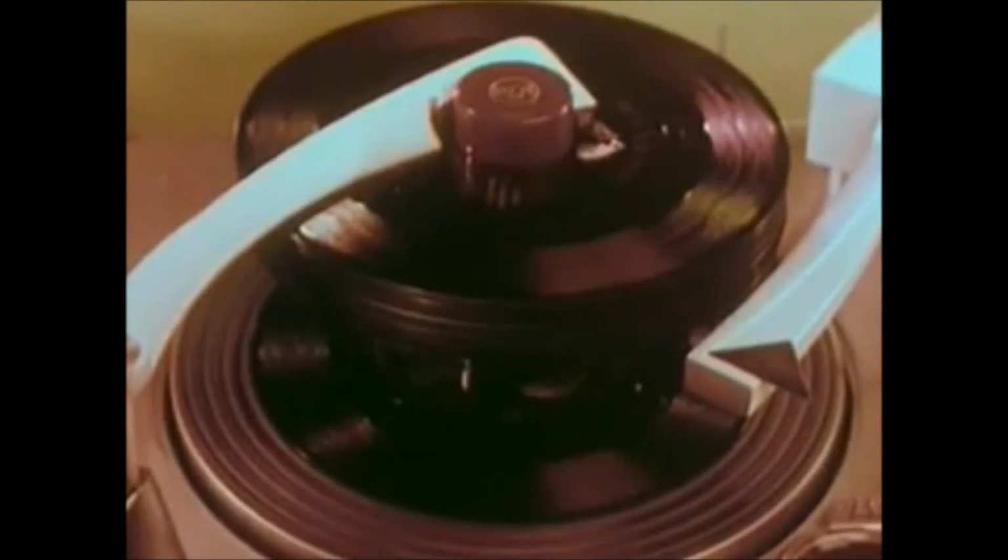And here's how. The old reel-type stereo tapes carried 2 soundtracks, one for each speaker system. The new cartridge tape carries not just 2, but 4 tracks. 2 in each direction for stereo, or 4 tracks for monaural, giving twice the playing time for the same length of tape. For monaural home recording, all 4 tracks can be used, giving 4 times the playing time, giving you more uninterrupted music than is possible from a full stack of 45 RPM records on an automatic phonograph.